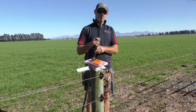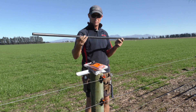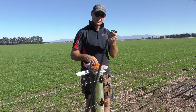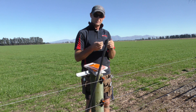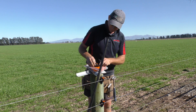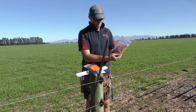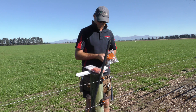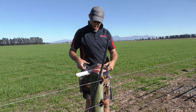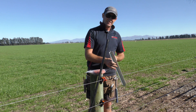I'm just going to show a few materials that Gallagher have brought out for their new irrigation crossings. The central items: your alkythene pipe which threads onto your wire, so that'll be in the middle of your fence where the irrigator wheel crosses. The Gallagher pin locks which come standard with a black pin, but they've also brought out special orange hardened pins, and they're generally on each side of your crossing. The new Gallagher clips, which I'll show shortly in a demonstration. They've also got their anchor ropes and D shackles which come as a pack, contents of 10. And last but not least their anchor, which is 400mm, gets driven in the ground — your D shackle goes on that and then anchor rope.